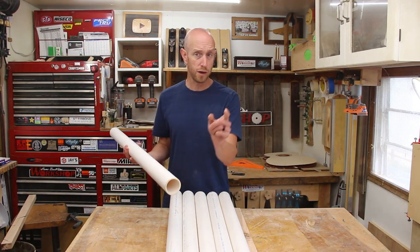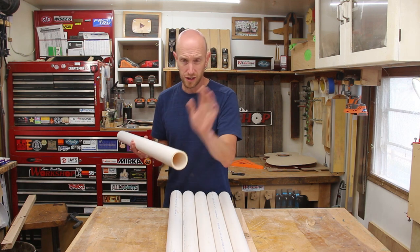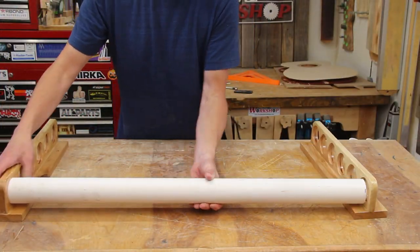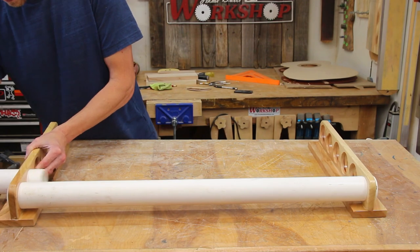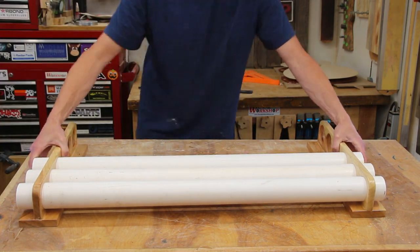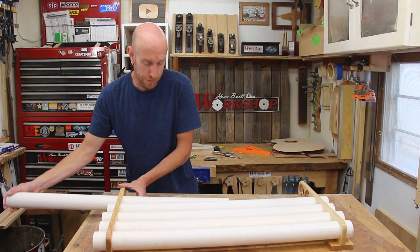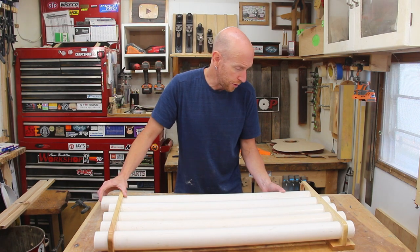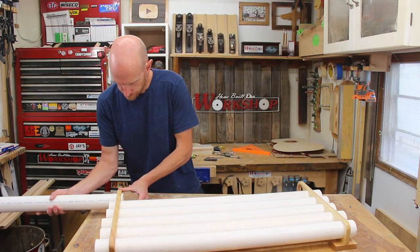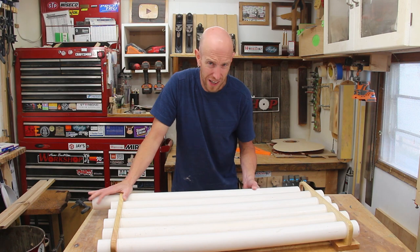While waiting for the lacquer to dry I cut down my PVC pipe into about three foot pieces. Now this is two inch PVC, but one thing to keep in mind is that two inch is the inside diameter. You need to measure the outside diameter and make the holes to fit that — if you just make it two inch it's not going to fit. Now, depending on where you mount this you may need to mount at least one side first before you assemble and install the pipes, because you can't really get to the mounting holes too well. I'm not a hundred percent sure yet where I'm going to put this, but I want to show you how easy this is to put together.